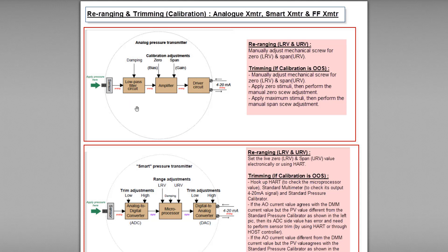After completing this process, I need to verify with 0 psi and 150 psi to make sure the readings are accurate. If they are not accurate, we have to repeat the calibration adjustment process. Note that sometimes you need to perform it a few times in order to get an accurate result.